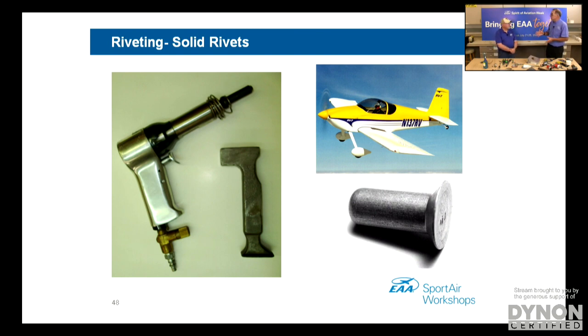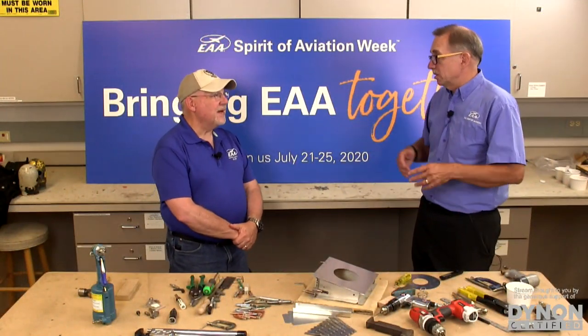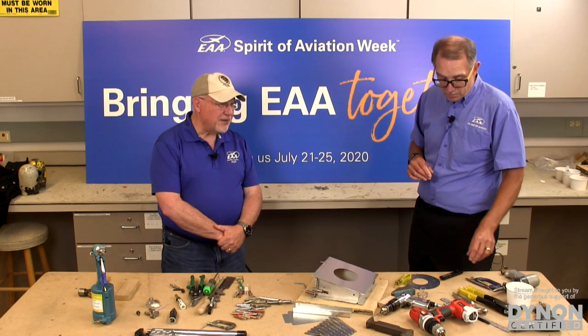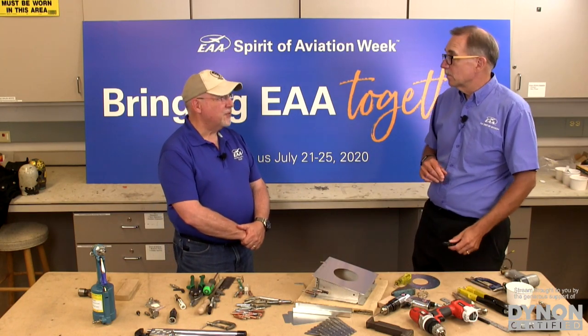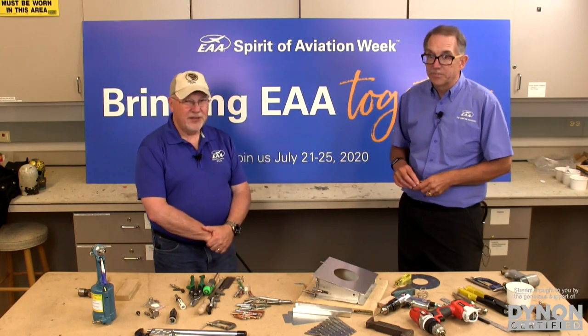Correct. The difference is that with pull rivets it's a much faster build time, because there's less equipment. The equipment is basic in terms of setting the rivets, and you don't necessarily need multiple people. You can do everything by yourself, but with most driven rivets, you need two people. There are some places on an airplane put together with driven rivets where it's impossible to do it unless you have two people. Exactly. Back in the fuselage tail cone or something like that, you're just going to need people to crawl.